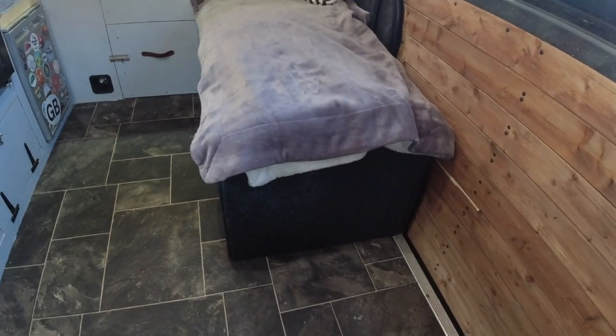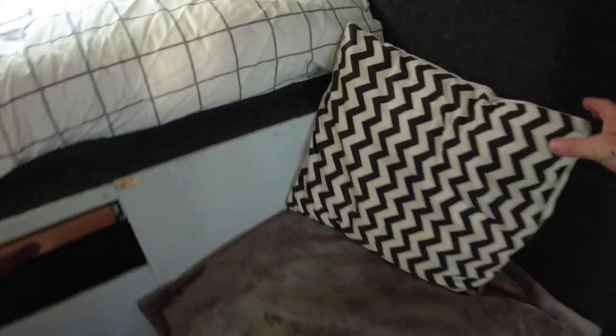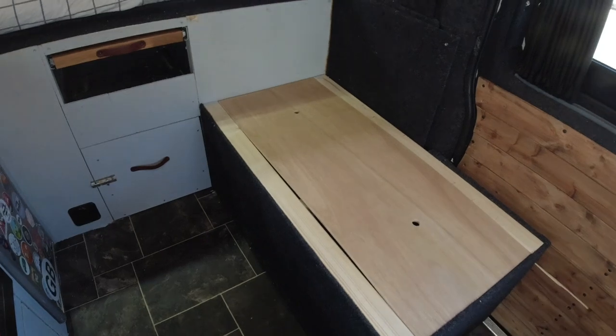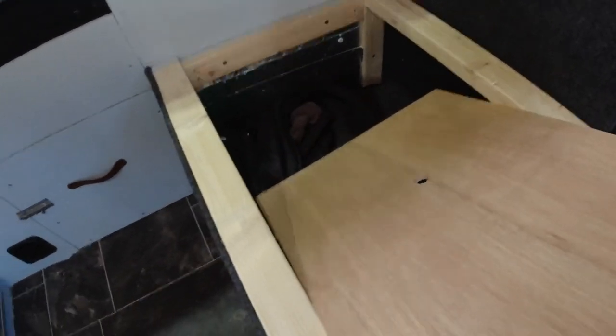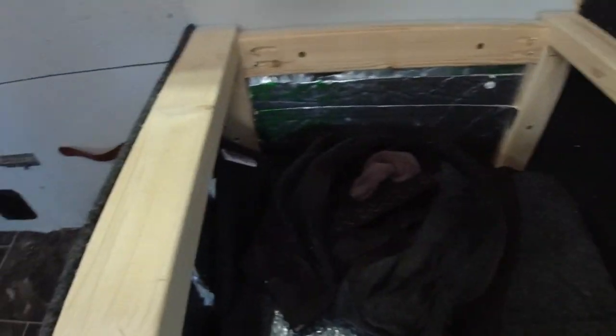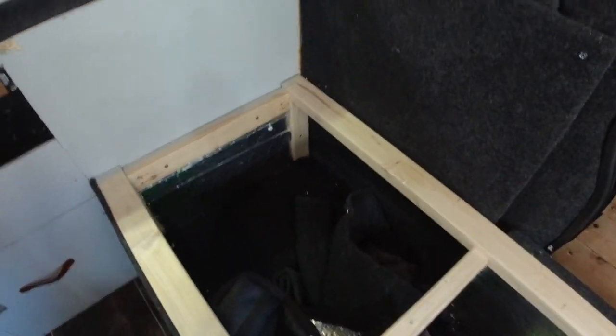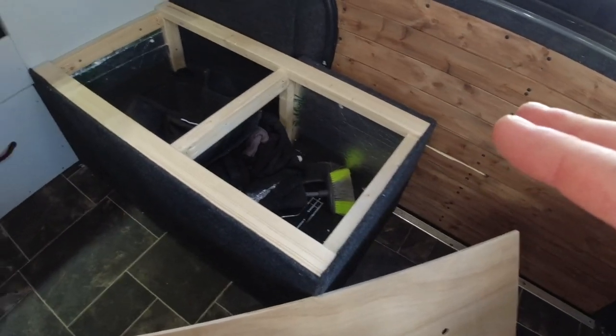This seat-in area has been done — it's not as long but wider, kind of like a dog bed, which is what I wanted. It's just a box seat with a lid that sinks down into it, still with a bit of a bend so it's comfy. Two little holes for lifting out, and inside it's been fully insulated. There's a little step over here because one of my LPG heater vents comes in underneath. That area has all either 25mm or 50mm Celotex throughout the seating area.